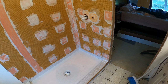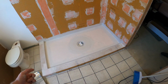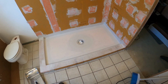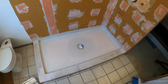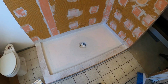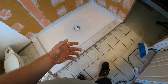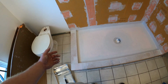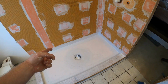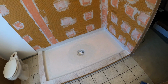And I think part of that will be that this stuff isn't so thick that we can't start pre-cutting the tiles for the floor, right? So once this is dried up, we start bringing some floor tiles in, decide how we want the grate to end up, and just start getting them ready. We can dry fit them. We can dry fit our whole curb. We can get our holes drilled for the glass. I'm not sure if I want to go as far as to start pre-cutting glass tile. I guess we could do the first. Oh yeah, we could start doing that too.